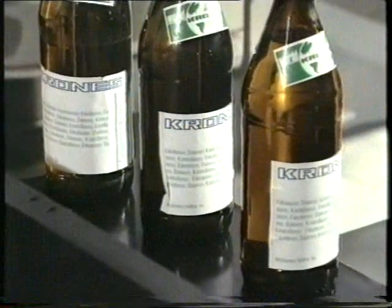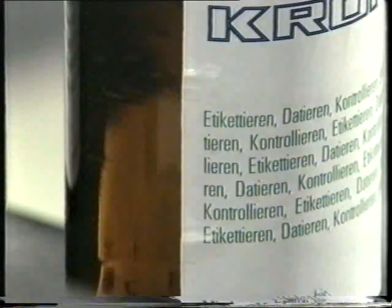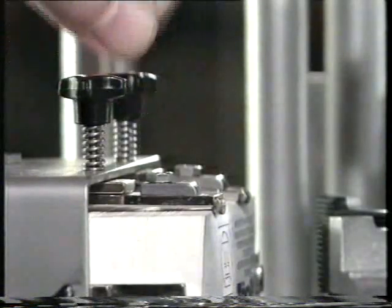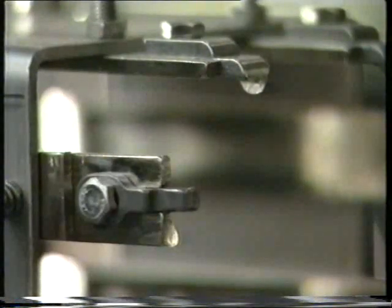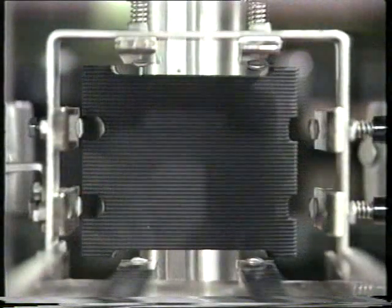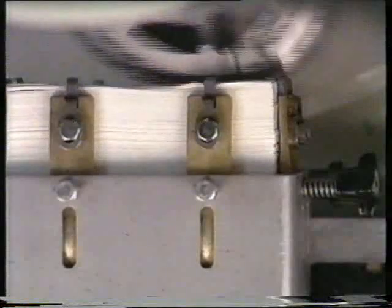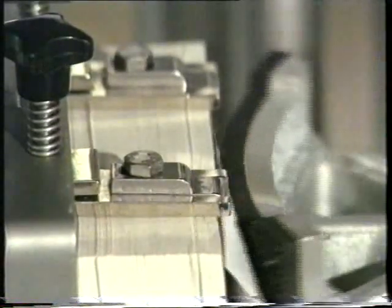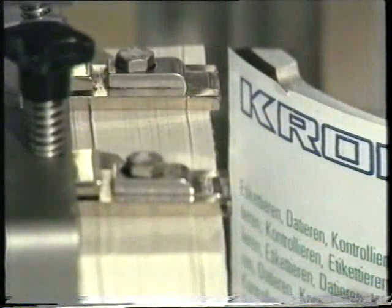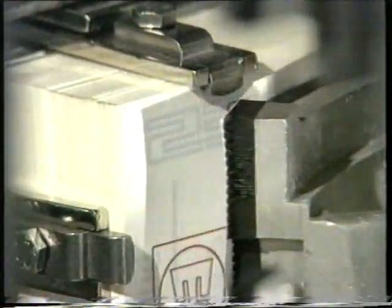From slanted labels onto damaged ones: the position of the damage on the label usually reveals the source of the problem. The position can be identical to that of the label prongs, gripper fingers, or bottle guide components. If the label prongs are the cause, first check the adjustment of the label guides with respect to the label size. Be careful about possibly dried-on glue residues. The prongs must be centered in the pallet notches so that the glue will not be transferred. If the pressure of the tension roller is too large, the labels will be pressed too strongly against the prongs. If the pallet's penetration is too small, the label is not pressed free of the prong's back edge. In both cases, the label is damaged during removal. For sensitive labels, the shape of the prongs may have to be adapted in the direction of removal.